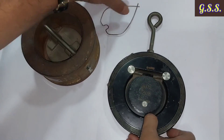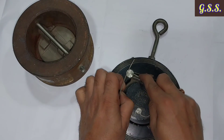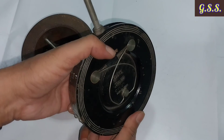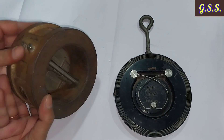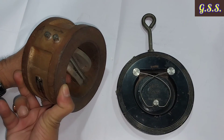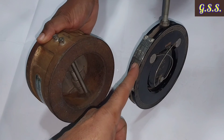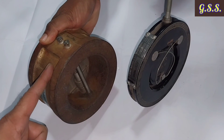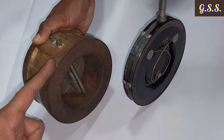The spring is now mounted again and the valve opens fully. Since pressure drop through this single flap check valve is much higher compared to the dual plate check valve, it is always better to use the dual plate type check valve.